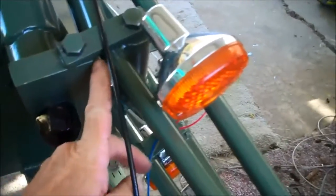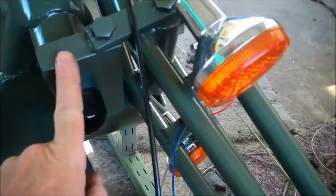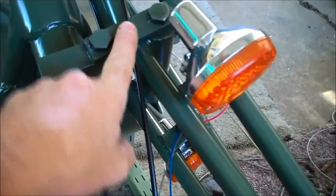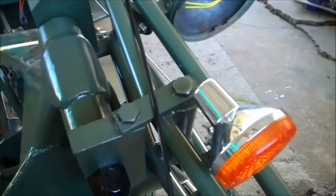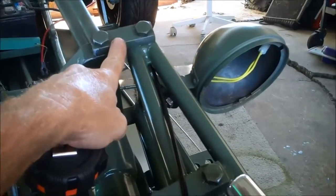When you cut these straps, you want it so that the front end is close but not touching the triple trees. You always do the bottom strap first, then set the pad point, get the front end at the exact angle that you want, and then measure and drill the top straps.